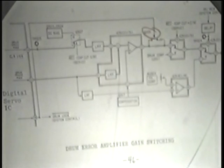The last sentence here says, please note that there is an error in the service manual on the base circuit of Q531. R633 should go to the drum lock line and not the RF switch pulse line. Circle that or underline it or something so you can change that in your manual. Why would we want an RF switch pulse line going to our servo anyway?